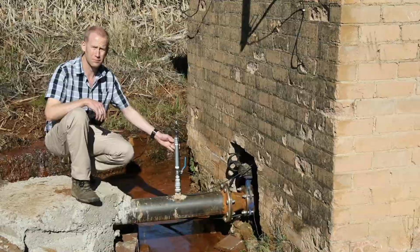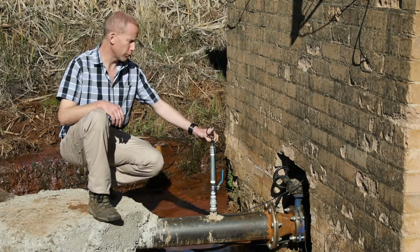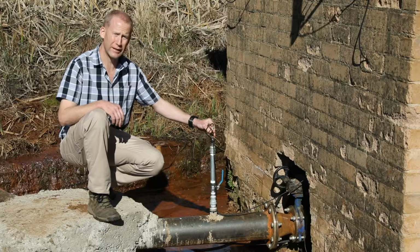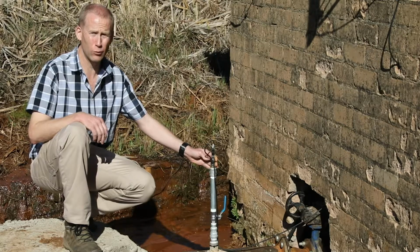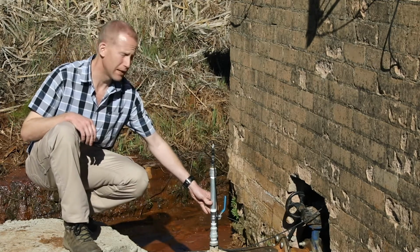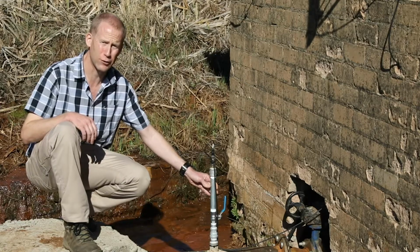damages the sensor. Once the sensor is installed, then it's important to secure the cable to the top of the sensor or the pipe so that if this cable is bumped, it doesn't do any damage to the top of the sensor. This sensor has been installed outside the pump house in Underberg, which is a very cold location, so it is likely that the water in this section of pipe will freeze, and that's why it's important to have the standpipe in this particular location.